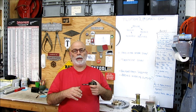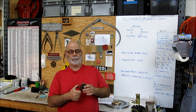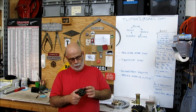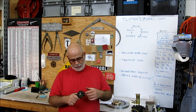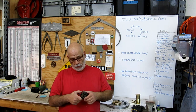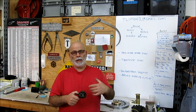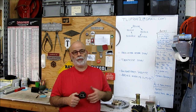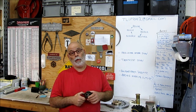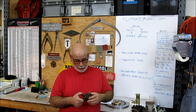And it's small and not too complex, so it's achievable — kind of a nice project. William Wigman had a really good suggestion: I mentioned before it has these little bushings that go in here to hold different tools. He said, just get a bunch of Jacob's chucks and stick them in there. And it's brilliant — it makes it eminently more useful. So if these were small chucks here, it'd be easy to swap the tools in and out and reconfigure this. I can personally say that if this thing had chucks in it, I'd probably use it a lot more. So it's the bushing thing that's kind of a drag. Thanks William, that's a good suggestion.